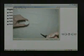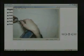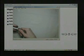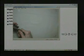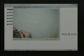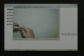These cylinders were running about $30 a piece, which when you start looking at what's in Home Depot, it's quite competitive, and you've got a much higher security. This is a grade 2 lock, whereas most house locks are grade 3. So it's just going to put up with a heck of a lot more. And I actually have a cutaway of it here that if it goes missing, I will personally inspect every one of your crevices because I will lose limbs if I don't get this back.